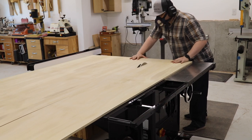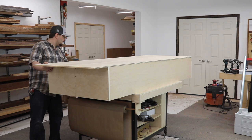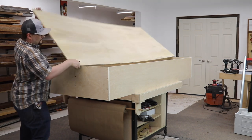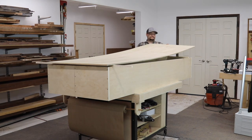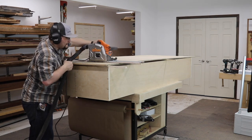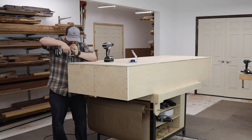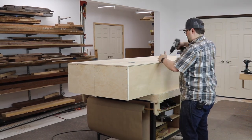After those shelves are attached, I flip the cabinet over, take a measurement for the width, and head to the table saw. I take just about a sixteenth or so off the width measurement and rip that at the table saw. Then I brought that over to the cabinet, positioned it, and found out the final length I need to cut. I flipped the piece over and used some cut-offs from my plywood to prop it above the cabinet, then used my track saw to cut it to length, and attached the back to the cabinet.